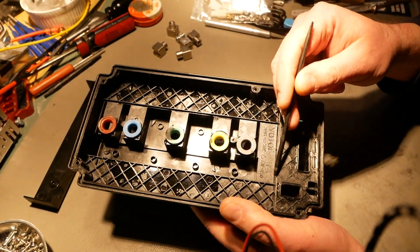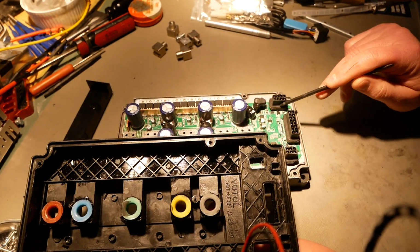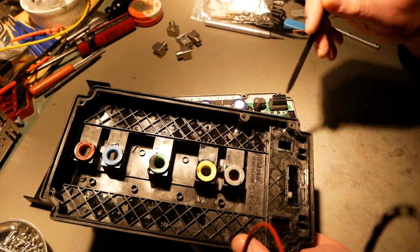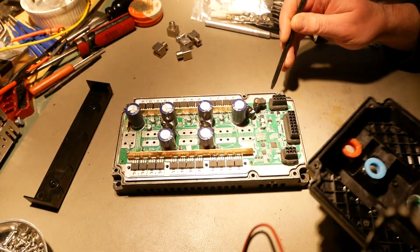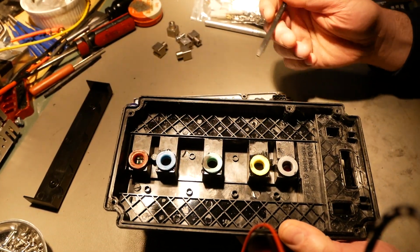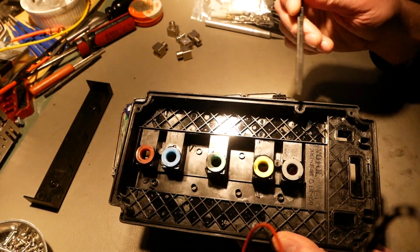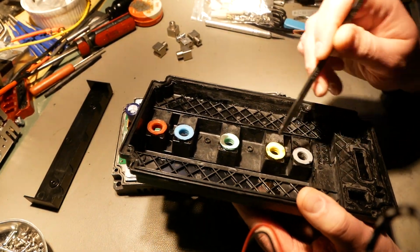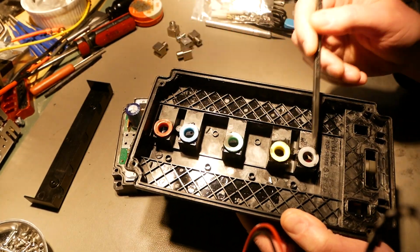These right here, those had silicone caulk around them, and then they were stuck down to the gasket that's on all the connectors, so that was all very nicely sealed. There was silicone caulk in this groove right here, and also inside here. So when those two things were mated together, they sealed up quite nicely. These grommets right here were not siliconed to the plastic. I changed that and added it myself. So if you can see the shiny stuff around there, that's because I did it. Otherwise, they were just fit in place. So I would have liked to have seen that be better.